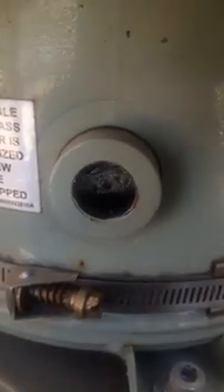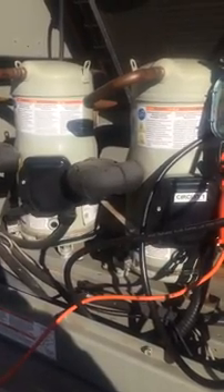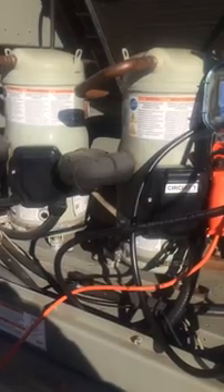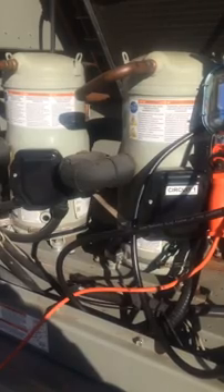You will see this bubbling up if you have a sight glass on a compressor. Now this isn't always the case — sometimes you have a compressor that's closed and you can't really tell what's going on. But all that oil inside that compressor is holding on to moisture that got into it from when I opened up the system, and refrigerant that is still sitting in it. It takes a while to get it out. Numbers might look good on your micron gauge, you might even pull to a really good number, but until you see all that bubbling come out and the bubbling in the oil stops, you are still logged with refrigerant. It will never look that great if you check a rate of rise when you see refrigerant bubbling up like that.